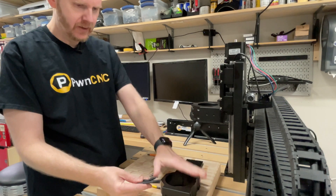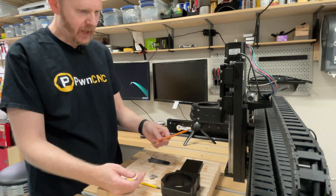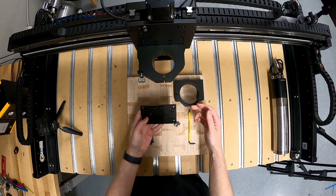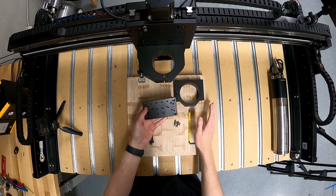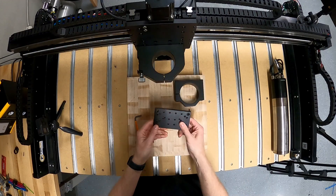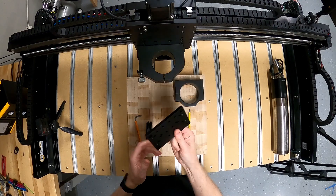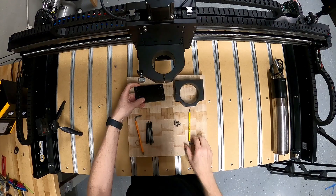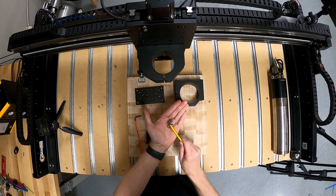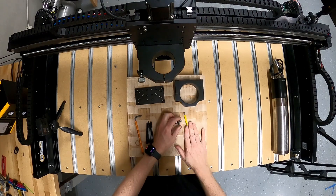The spindle mount and four M6 screws come with that — long screws come with that. You'll need an M5 hex wrench. Along with that we've got an adapter plate. The adapter basically allows us to put the same mount on a variety of different machines in order to add 80 millimeters to basically any machine that we have an adapter plate for. This adapter plate is the one for the Shapeoko 5. We've also got four M6 small head screws, for which you'll need an M4 hex wrench.